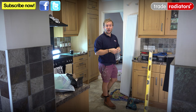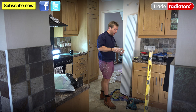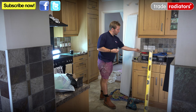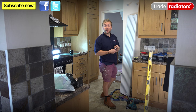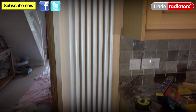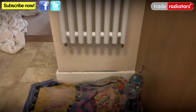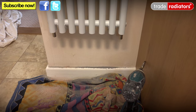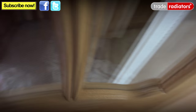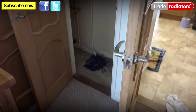The radiator is now hanging up on the wall, nice and straight, so I can pop on the decorative shrouds that go over the top of each column to make it look lovely. With the radiator installed, the next step is to go down, pop our two rad valves on, then drill the holes through the wall to connect up to the two pipes just through here.